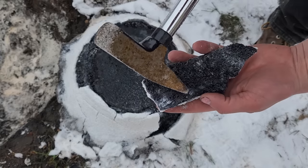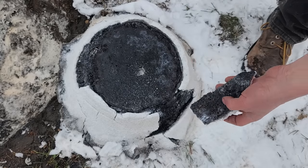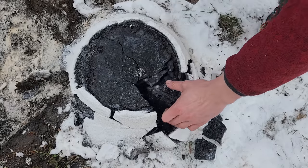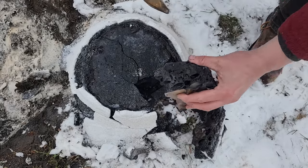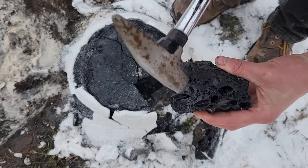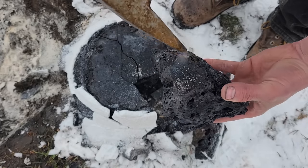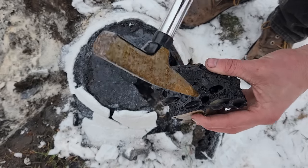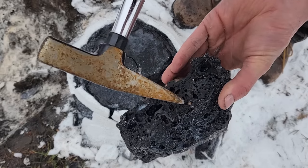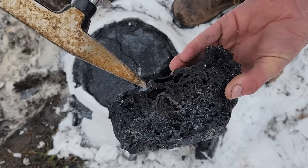The sand is fused to the side — it looks like glass. The sand melted and mixed with the alumina. There are little bits of iron in here, so not all the iron made it to the bottom. This material is basically sapphire — it's just polycrystalline and full of bubbles and contaminants. The dark coloring is probably iron oxide that dissolved into it.